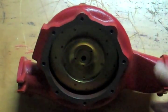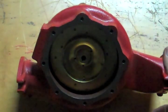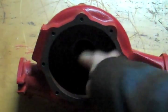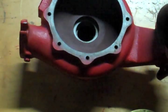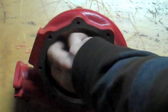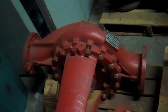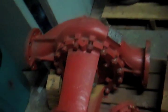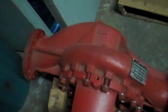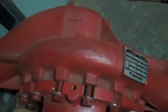We're going to take a look at the back side of the pump. This is the volute with the impeller in it. You can see the scrolling goes this direction — that's your suction side. There is where the water comes into the impeller. That suction side of the impeller goes right in there; there's where the water comes in. That impeller spins, forcing the water out in the direction of that scroll. This is a much bigger pump right here, but you can still see that scroll and where the suction side comes in to the beginning of the impeller. The scrolling goes this way, so this makes this the discharge side right here; that is the suction side over there. I hope all this has helped.